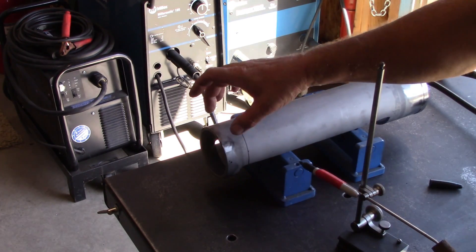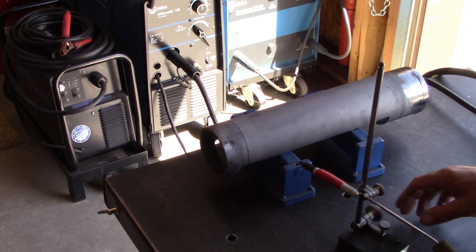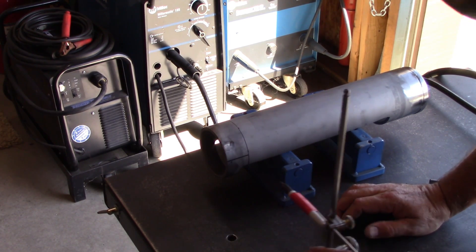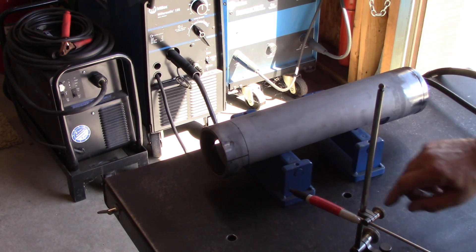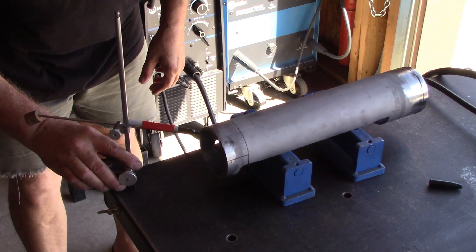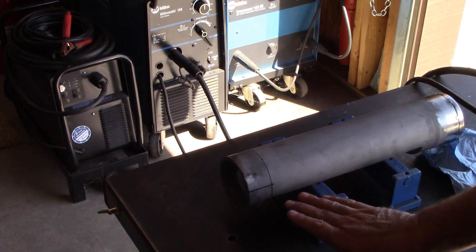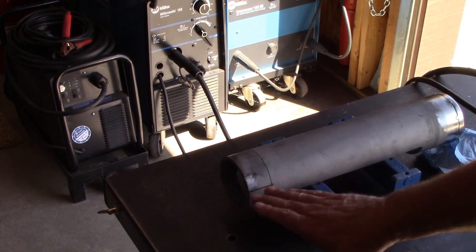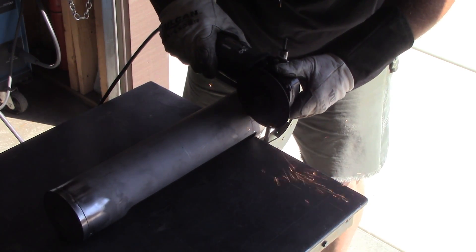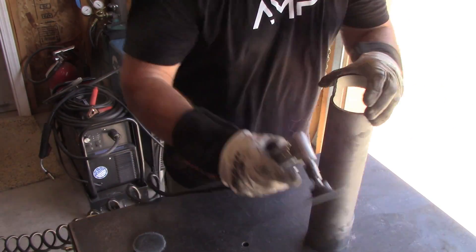Now I'm marking for this piece to be cut out — this is where the cans and plastic bottles are going to exhaust or fall out. I'm going to eye this because I want to make sure I have enough material here for strength. If it's a little too much I might come up a little to give it more meat. This opening is going to be an inch and a half, just below the center line of the three-inch ID tubing, so I should have enough material for strength.